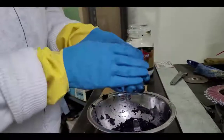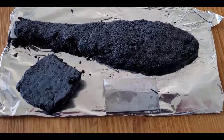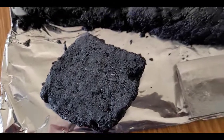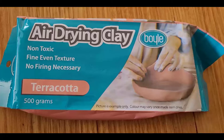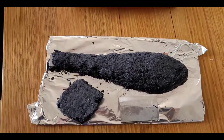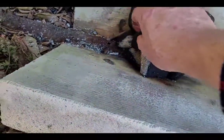You want to ensure that you coat the edge well where you want the carbon to be absorbed to harden the steel. While I covered the whole thing, I'm not sure that's so important unless you need the entire piece to be hardened. The carbon wrapped sample was then left to dry along with the un-carbon wrapped sample and a knife blank I'd also created and wanted to carbonise. I wanted these to dry out well because the carbonising process should be done without oxygen, so you wrap the carbon wrapped sample in clay to prevent any air getting inside. As long as there's no moisture being given off, I won't potentially create steam and break the clay wrapper around the sample as we're carburising it in the forge. And as you can see, there's a small cut in one of the samples to allow us to differentiate them later during testing.